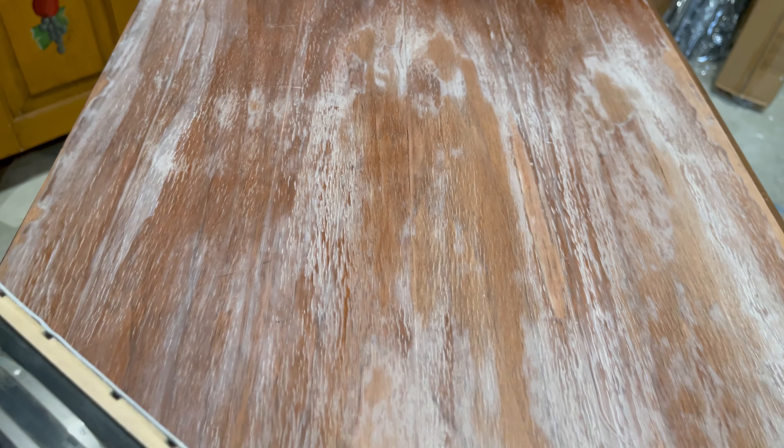Here's that area — it almost looks like I have a little canyon going on. Do you see it right there? So now it's flatter, but I have this gap. I'm hoping I can get it glued down, fill it with some wood putty, stain it, draw in some wood grain, and make it look like this never had an issue. I'm going to continue to sand — the next time you see me, this top will be completely sanded.